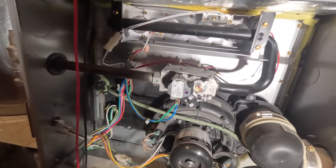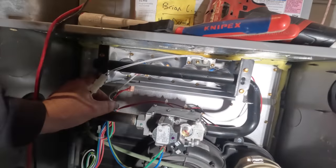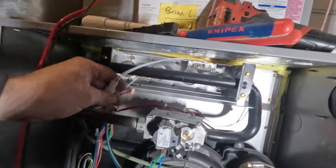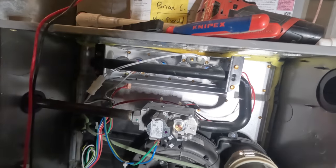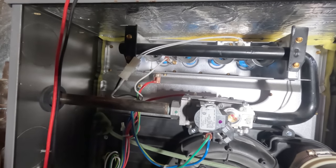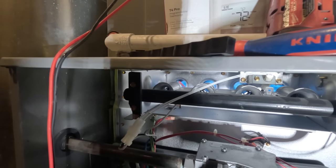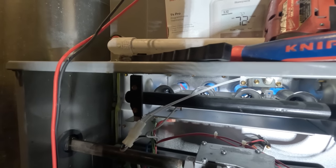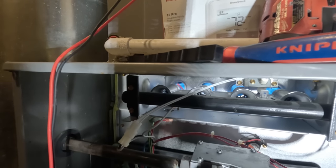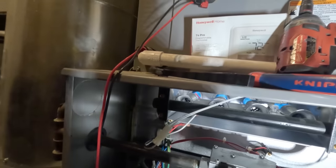It's burning pretty clean; everything looks really good and smooth. Ever since these silicon nitride igniters, we really haven't had any problems with that anymore — it's definitely an improved furnace over the old ones. Now see how that sensor there gets so red? That's always a bad sign because that's why those get dirty so quickly. They must have used a cheaper metal, and that tends to absorb any contaminants floating in the air — they get blocked up and it bakes right into them.